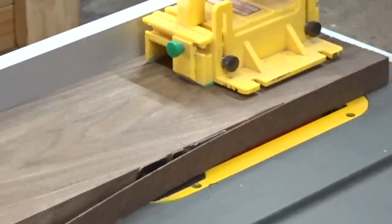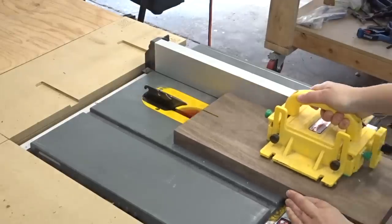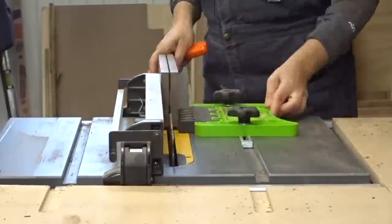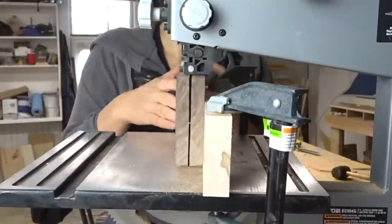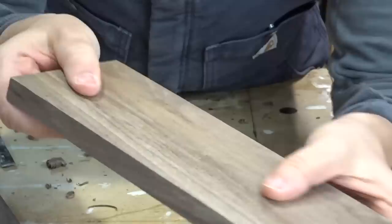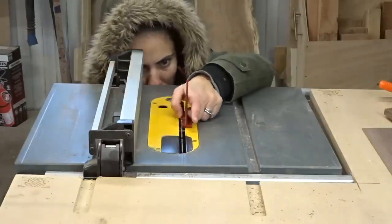After the panels were finished I got to working on the sides of the box. I had a five-quarter piece of walnut that I milled up, cut to size, ripped in half, and then resawed those two pieces again. I finished the cut on the bandsaw because they were just a little bit thick in the middle, and cleaned it up using a block plane - it's really fun to use sometimes.